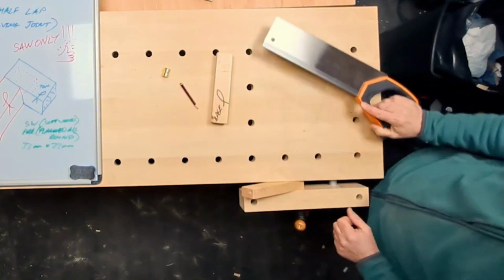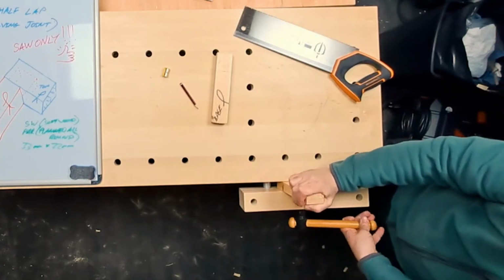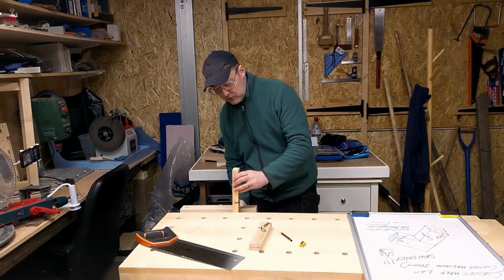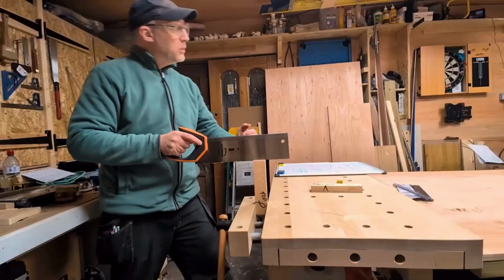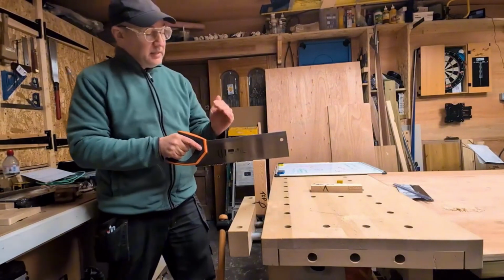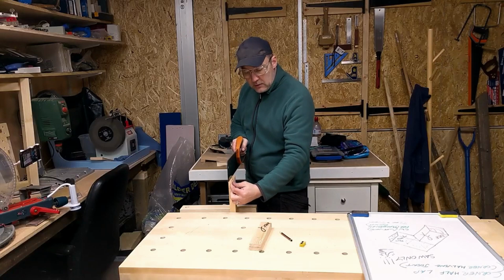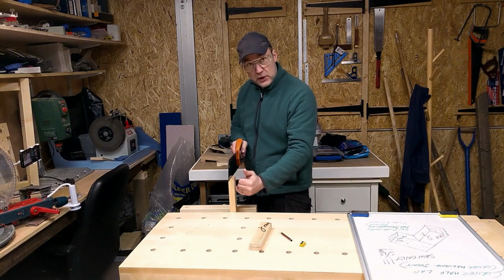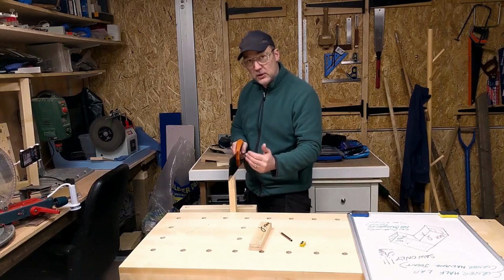That's through there. When we do the kerf lines like this, that means now step 4, when we step that up, I'll do it so you can see it. When we step that up, I'm going to cut through it. Now I'm going to cut all the way down, but I don't have to keep coming and checking to look on this side to see if I'm straight. I can stand back here and focus on this line and come down here because the blade should now follow my kerf line. It won't follow a pencil line, it'll go wherever it wants. But if there's a kerf line in there, it should follow that kerf line. You can check it a couple of times, but you don't have to check it as often.